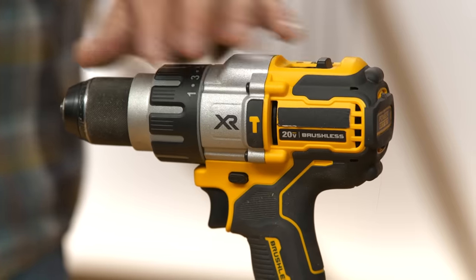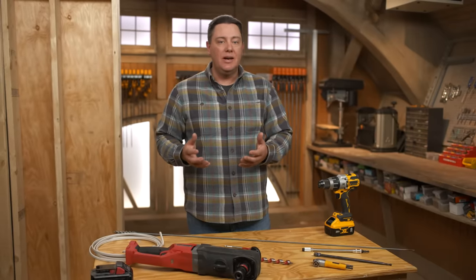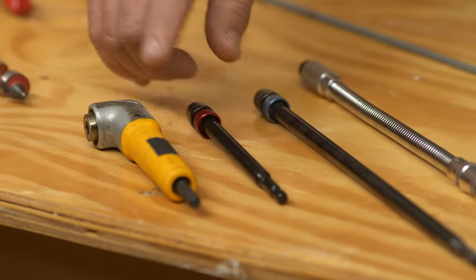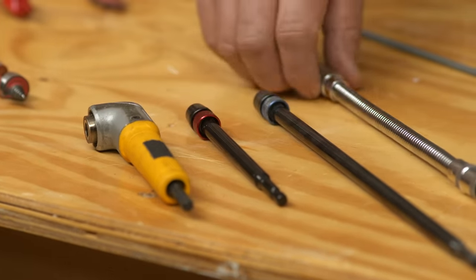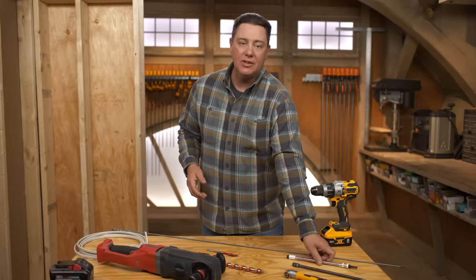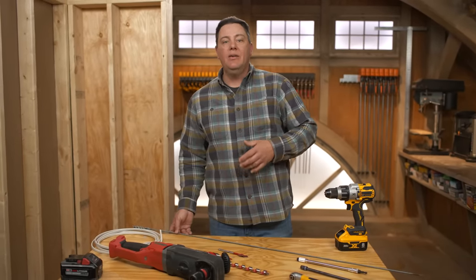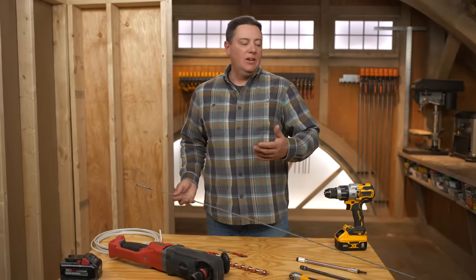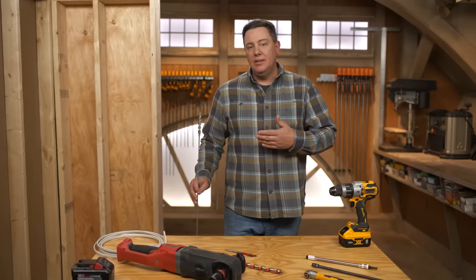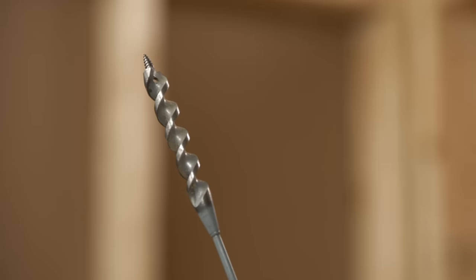When it comes to making these holes, a straight bit isn't always going to be the right answer. Sometimes you have to work around a corner or a tighter space, and that's where some accessories come in. In those cases, we can use an assortment of extensions, a right-angle adapter, or even flexible bits that can help you get around corners you can't reach easily. And finally, in some tighter areas with blocking in a wall you can't see, we're going to use long flexible drill bits that let us snake up walls without damaging them.